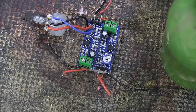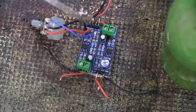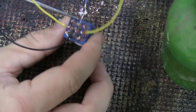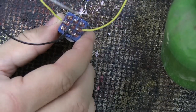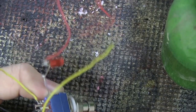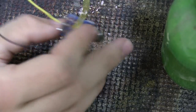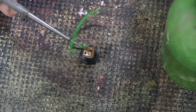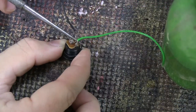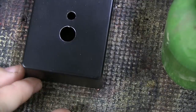Here's what you're going to need: it's actually much easier than you might think. You'll need two output jacks, a true bypass footswitch, a resistor — around 2.2k if you're using a large LED — a power DC input jack with a black wire on the big lug for ground and a colored wire for the positive lead, and finally a pedal enclosure. You'll need to drill holes for signal in, signal out, power, LED, and the switch — and optionally one or two holes for gain knobs.